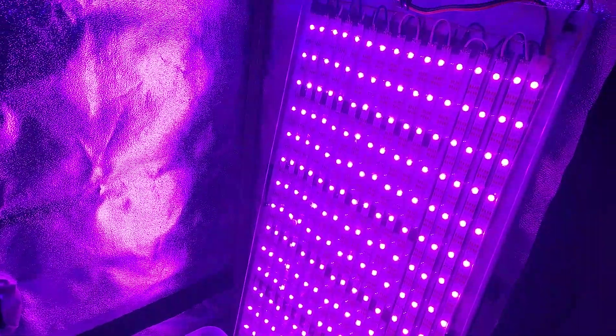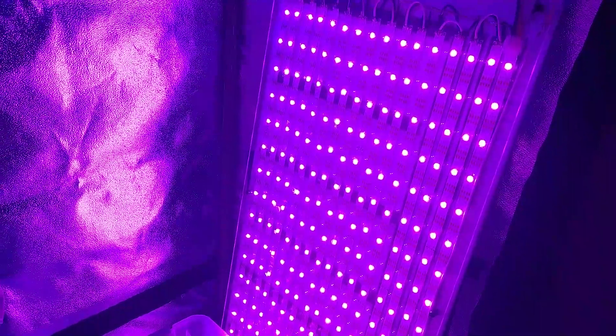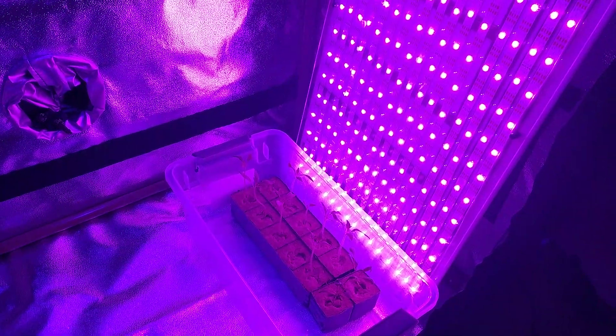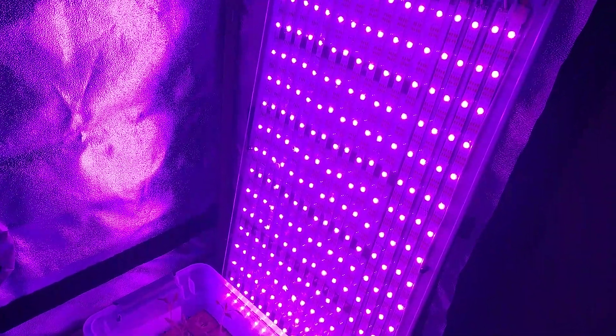As you can see I am totally purple in it out here, so let's open it up and I'll show you what I've got going on. Sometimes the lights go crazy and that's because this is my RGB matrix panel — I was going to do a build video of this. Each individual light's color is controllable, so each individual pixel, which are the little dots you can see, have three diodes in them: one red, green, and blue. Right now I'm just running full blast red and blue, and there's a little bit of noise in this power supply — I'm driving it very hot.